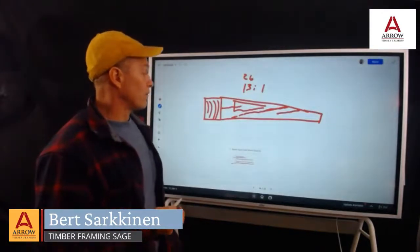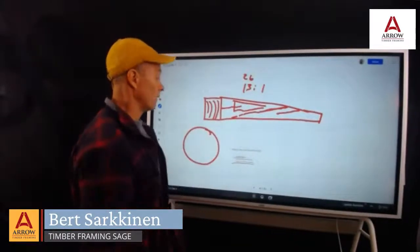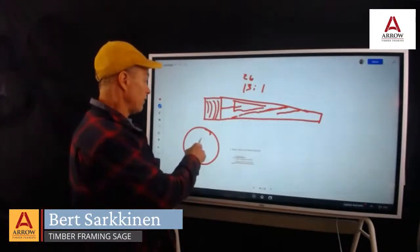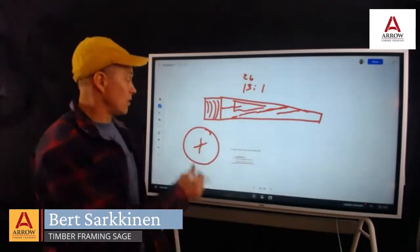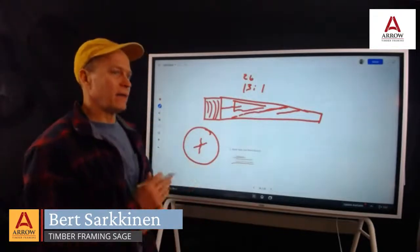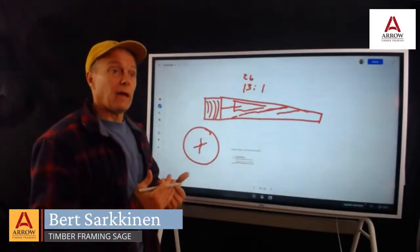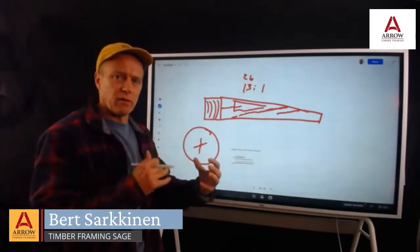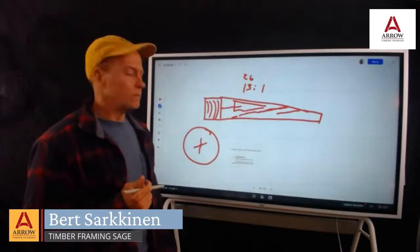So with pitch cracks and wind stress, that happens. Here, I'll just show you this. If this is the butt end of a log, one thing with buying really high quality logs, and when there are pitch cracks in there, especially something like this, that means any way you cut a beam out of here, you're probably going to be hitting pitch and weird pieces. That makes the wood leak pitch in the first place, and in the second place, it'll give you funny strength in how it takes strength and then reacts to loads.